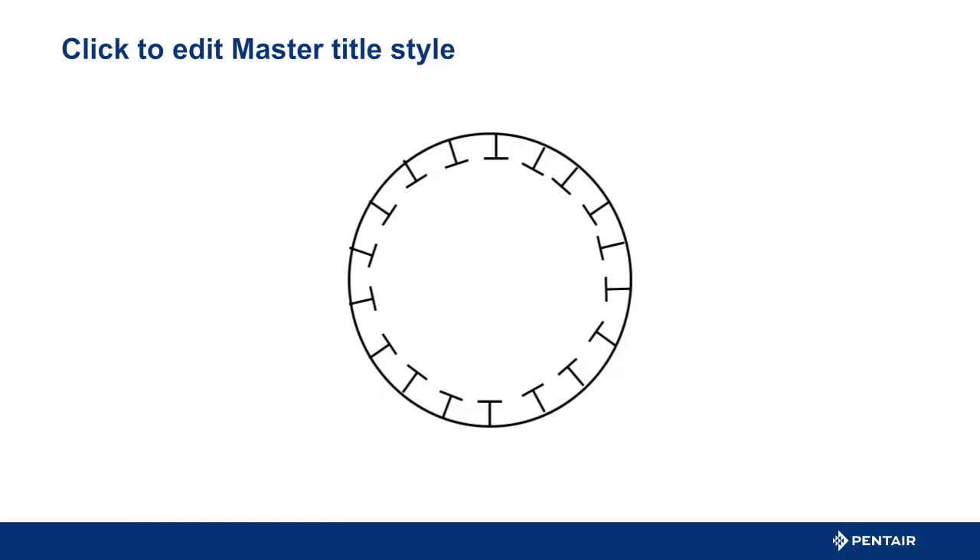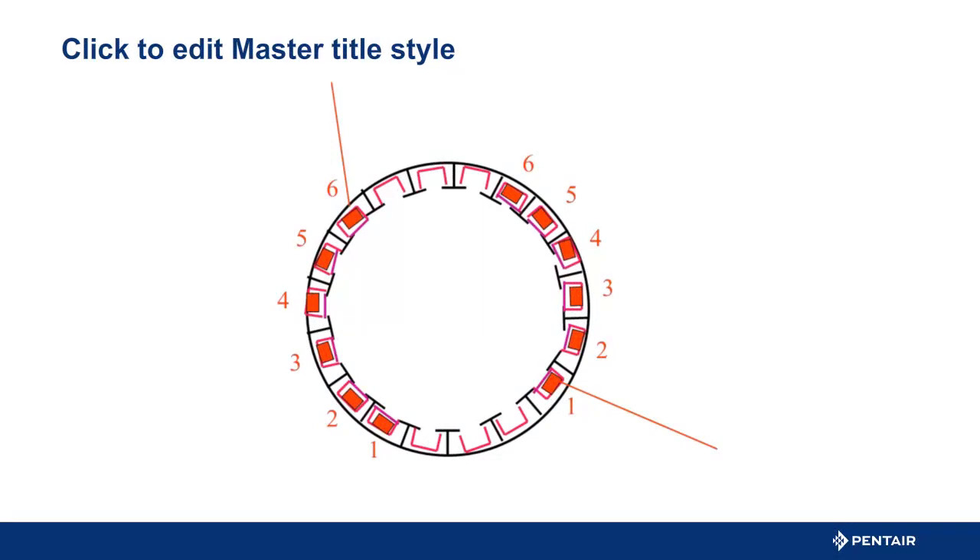Breaking out my crayons, you see here a simplified drawing of a stator with no windings. Drawing some in — I only drew the main windings. I paused here to explain how a single-phase motor works. Unlike a three-phase motor that always has all windings engaged, to start a single-phase motor we need to imitate a three-phase motor. This is where the missing start windings come into play. In a single-phase three-wire submersible motor, the starting components are in fact in the control box.